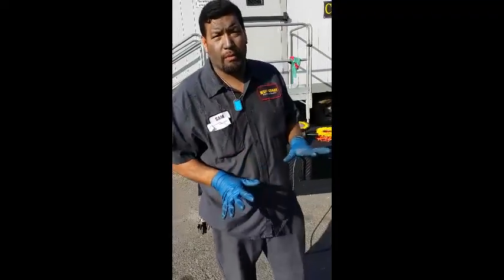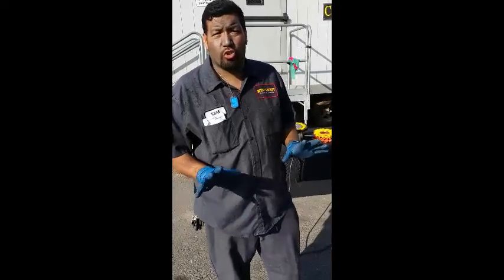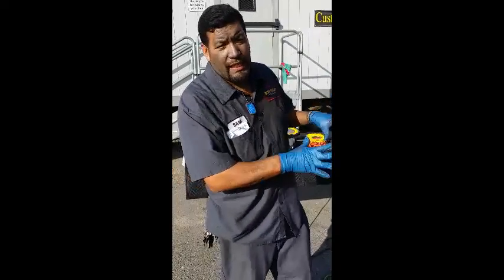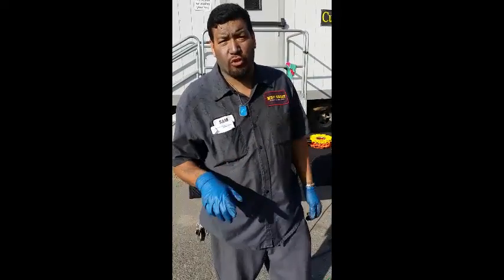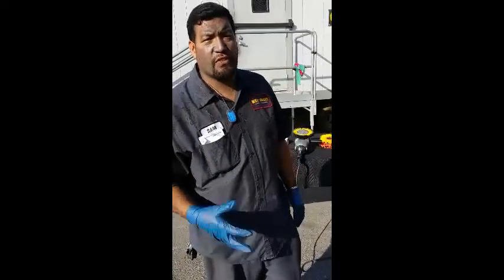And all the residue embeds itself down into the aluminum. If you really want to get a great finish, you really want to practice some sort of intermediate techniques to clean your work. Because if I leave the brown rouge on there and I go to finish it, it's going to have a burning rubber effect with the finishing compound, and you'll have holographic marks inside your work, and you don't want that. Again, this is a learning process. The more you do, the more you're going to learn. You just got to find your niche and find your technique.